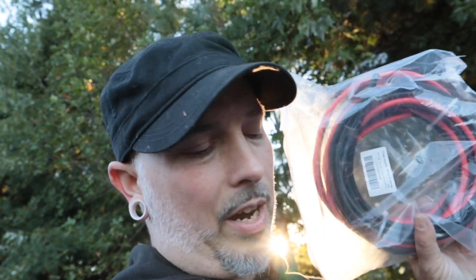I've also got 10-gauge wire which is probably fine, but to minimize voltage drop on the run I might use the 4-gauge booster cable wire. At the end of the day, I did connect all panels together in parallel and was getting about 17 volts, which is fine. I wasn't able to check amperage because it would exceed my multimeter's 10-amp limit, but all individual panels gave good readings.